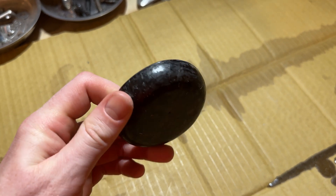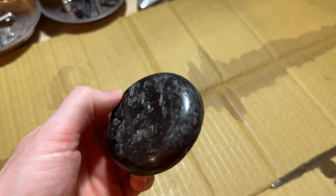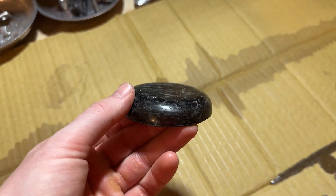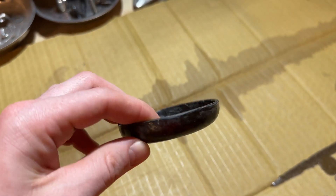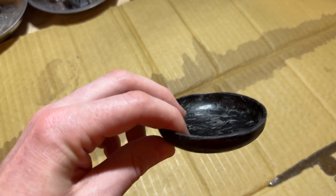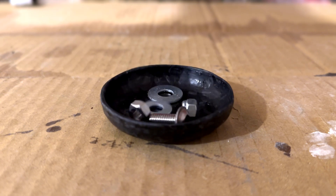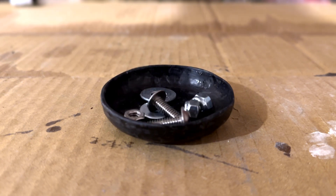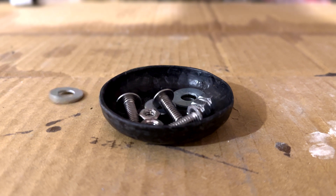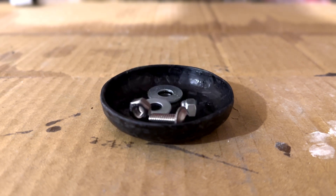Here's the final part — just a small carbon fiber dish. It was a way for me to experiment with forging carbon fiber and figure out the process and what does and doesn't work. The 3D printed mold worked really well; I think my design was just a little bit off. I need to draft the walls a little bit or make it easier for the bowl to slide out. A flat part or a completely solid part would probably work a little better. As for lubricant, I think petroleum jelly is sufficient, but a proper solid release agent used for molding processes would probably be even better. Overall, a pretty easy process — I like it.